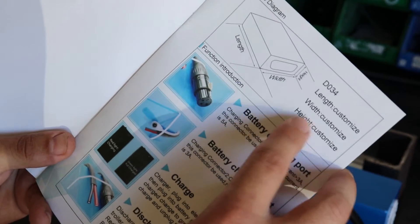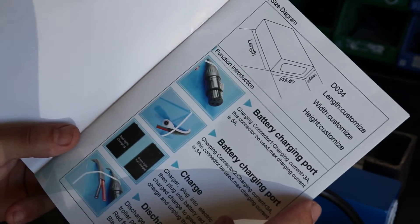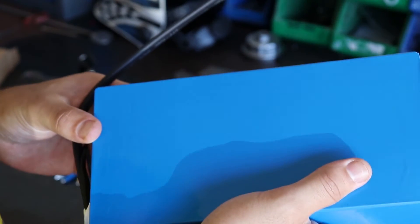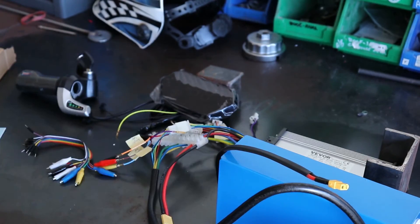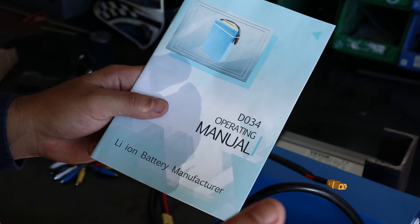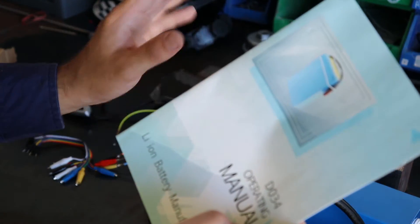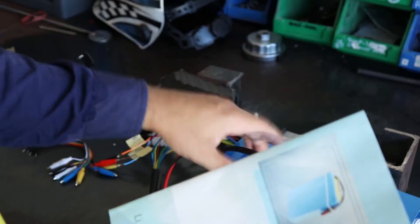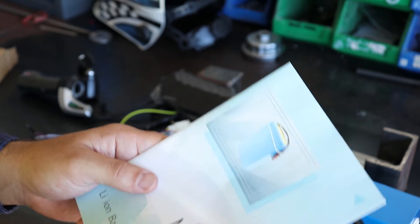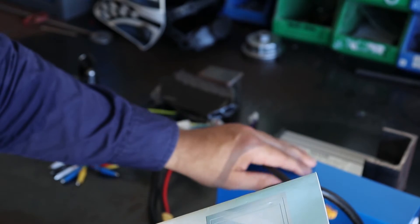The manual also shows dimensions: length, width, height. The reason it says 'customize' here is because depending on the type of machine it's going into will depend on how they configure the battery. In this case it's in a rectangle, but you'll notice that some batteries are triangle, round, square - whatever. Depending on what you're trying to fit it into, the shape of the battery can be changed. That's because those 18650 cells can be arranged in any shape you need, because they're singular. Inside here there's a 3D printed rack that holds I think about 50 to 60 cells individually, all formed into that shape. I've seen off the same site you can get round, triangular, rectangle, and square batteries.